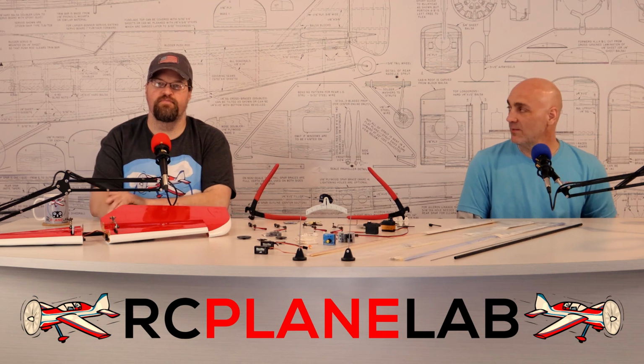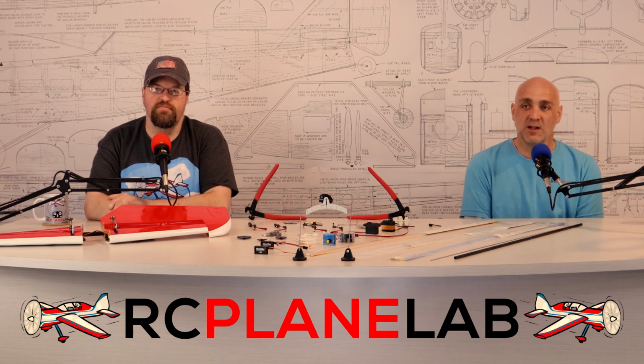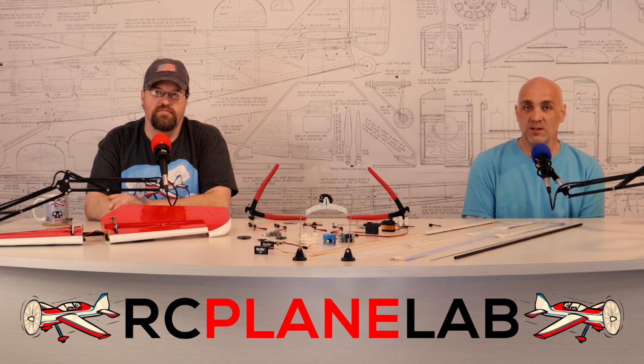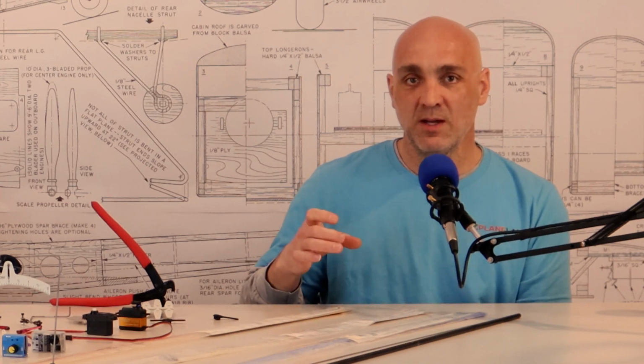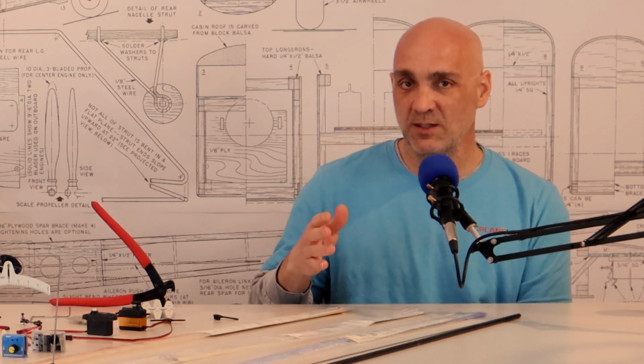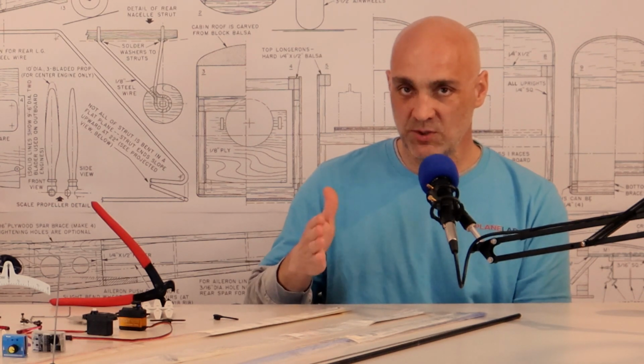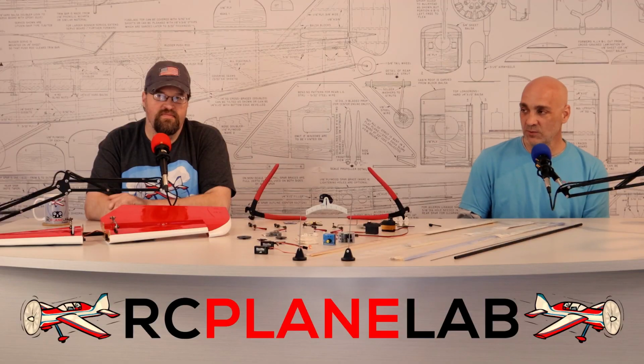There are probably other names for them too, but a lot of people assume, and I did too for a long time, that a 6-legged servo arm was in case you needed 6 connections to the servo. That's not exactly right. And we'll talk about this in a little bit, but it allows you flexibility on how to mount that arm so that you can get it exactly centered where you want, and you get that leg exactly in the position that you want it in.